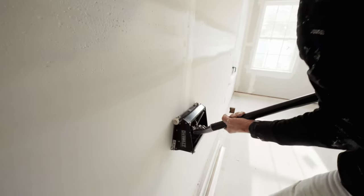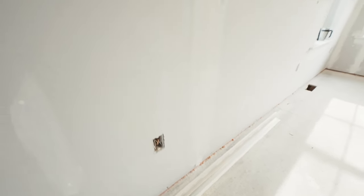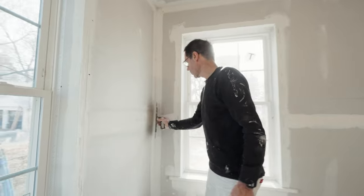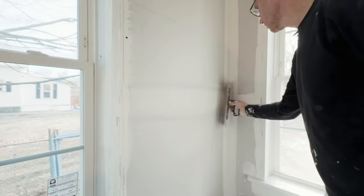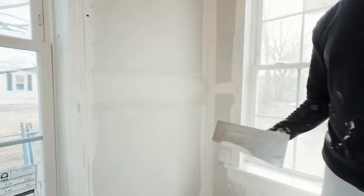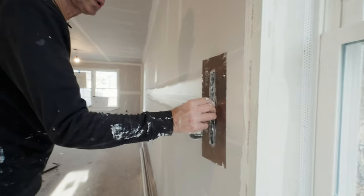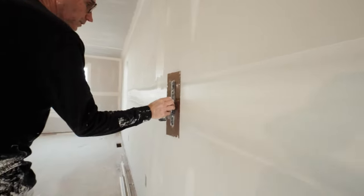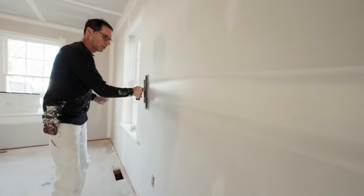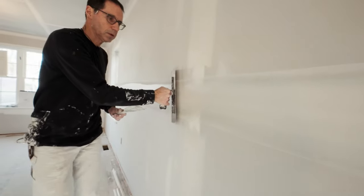Same thing here — starting along the bottom, pulling up. Now because they intersect, I'm going to have to do a little bit by hand. I take my bevel trowel, nice and clean, and I just pull that right over the seam. It makes it look a lot better — I remove some of the compound, get it nice and tight, and remove most of the air bubbles. I'm going to do that on all these seams on the walls, just pulling the trowel along the seam. Because I had a little too much compound to start with, I just go right back over it. There — that looks really good.